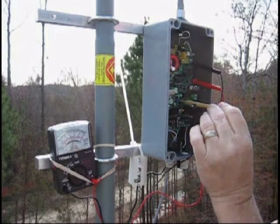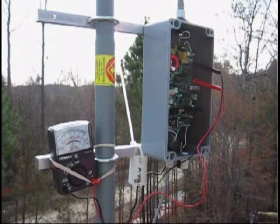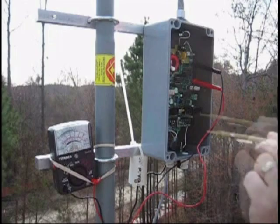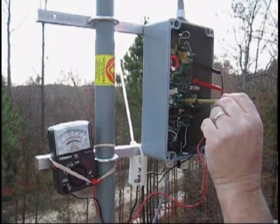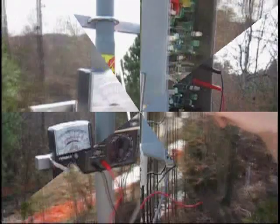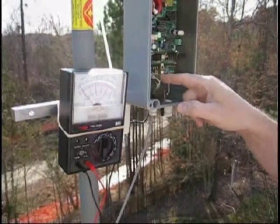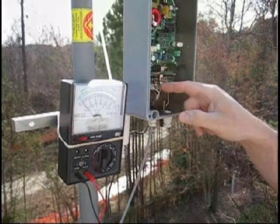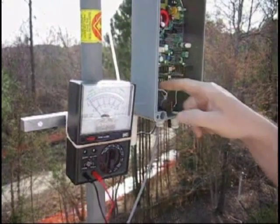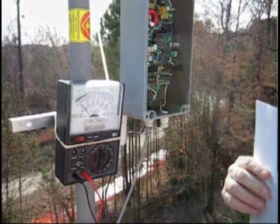Be sure and return the audio pot back up to maximum after you've tuned the transmitter. I usually leave the pot at the transmitter at maximum and adjust the level from the ground. You can use either terminal block — the red and black are for power (red plus), and the green and black are for audio. I have the shield connected to the ground here. Don't connect the shield at the other end; just connect the shield at one end.